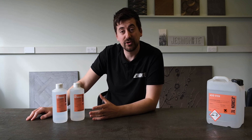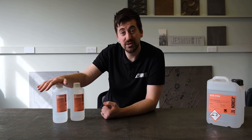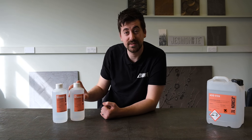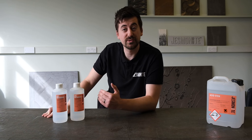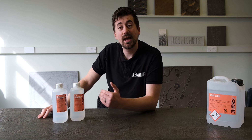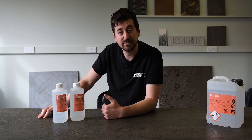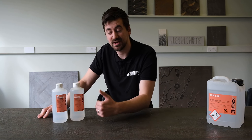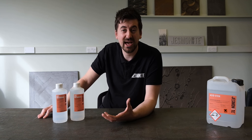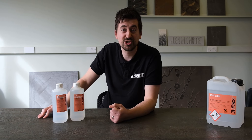In order to slow down the setting time of your materials, we also have Jesmanite retarders. We have a specific retarder for AC100, 200 and 300 and another for AC630, 730 and 830. It's really important to make sure you're using the right retarder for your application because they don't cross over, hence the separation. The retarders can be added between 2 and 10 grams per kilo of mix and they can extend your mix pot time from about 15 minutes initially up to half an hour or more dependent on the addition rate. It's great for larger moulds and larger scale applications where you're filling multiple moulds, because it ensures the mix is workable for much longer.